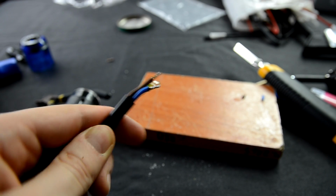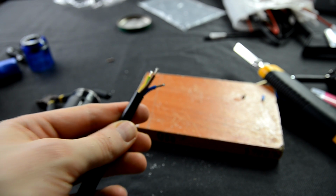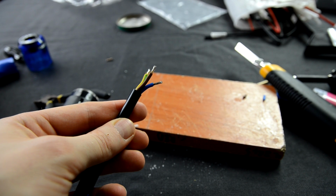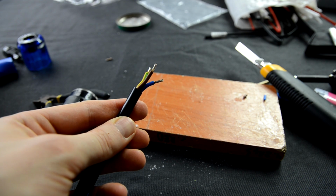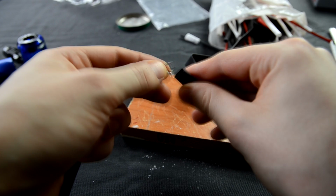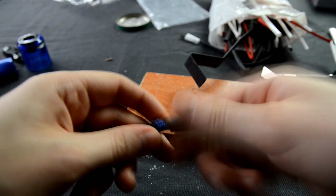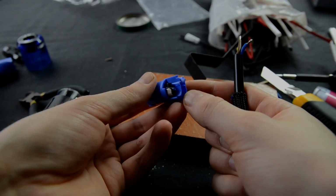Here is the wire after it got soldered. You can set up the PowerCon jack without soldering, but soldered wires oxidize slower and give better electric conduction. Put a heat shrink tubing on the braided sleeving, so that the sleeving would not slide off the power cable. You need to do this action for both of the cable ends.